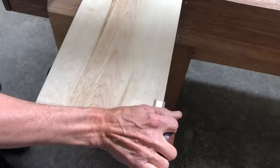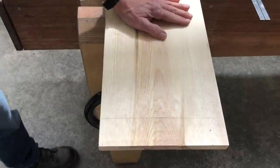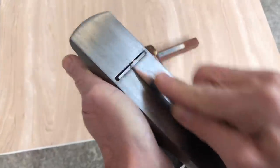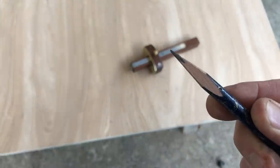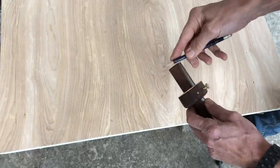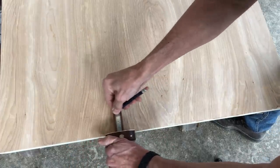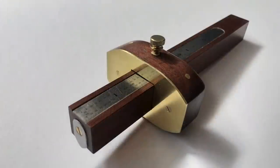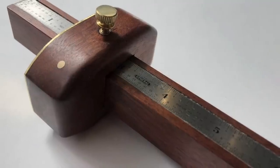We'll do a little test scribe and I think that's successful. Before I mark with a pencil, I get a good sharp one and then I run it on my block plane a few times and get a nice flat spot on it. That flat spot then allows me to hold it flat against the gauge. So that's my version of a classic marking gauge, updated a bit.